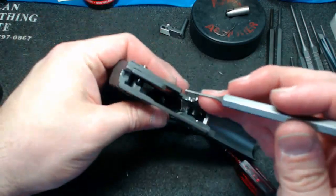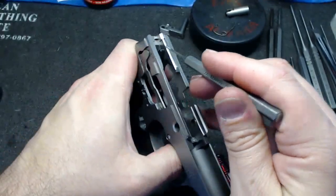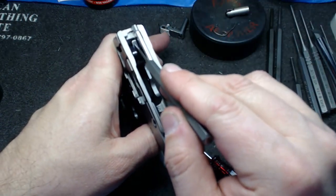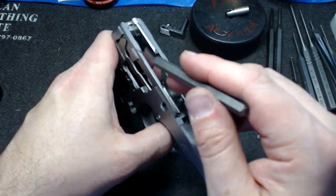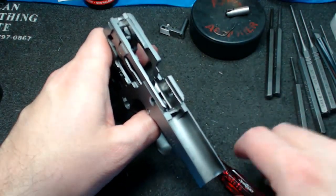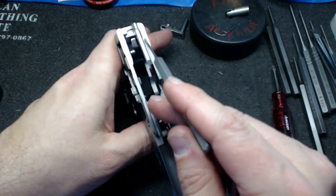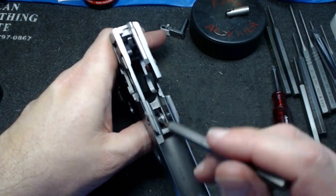Now the sear pin goes through the sear itself and the ejector. And there's a spring between these two pieces, and it lives in a cavity in the ejector itself. So it's a really novel design. It's an odd type of compression spring. It's the same kind of mechanism as the burst cam on an M16, but you'll see it when we get out there. Essentially, the pin is holding two pieces, and in between them, where you can't see, inside the ejector is a little coil of spring.